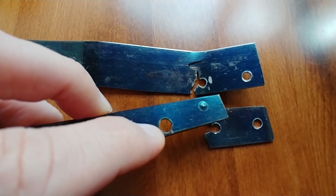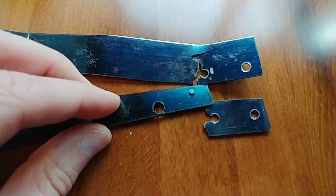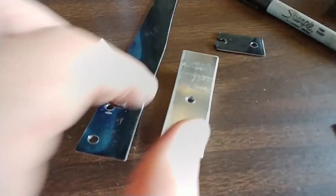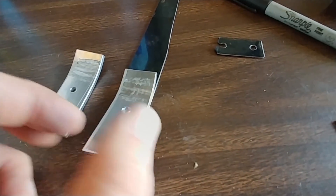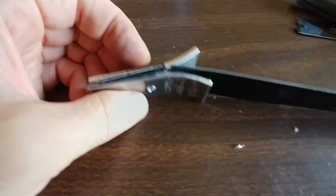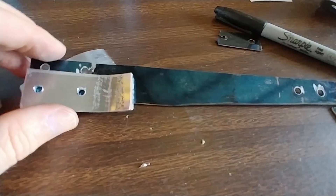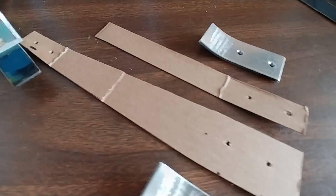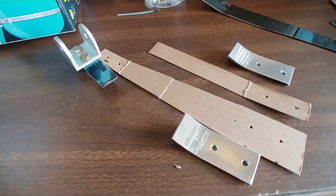I've taken a sample to a local sheet metal shop and they've punched a hole in it as a trial. I've ordered more spring steel from McMaster and I'm going to get them to punch the holes rather than drilling them myself, and they have a shear so they can cut it to shape rather than me using an angle grinder like last time. I've also created these aluminum blocks to distribute the load at the point of maximum bending — so instead of it flexing around where the holes are, it'll bear against those eighth-inch aluminum blocks. I'm still going to have a similar shape, just a little wider on that piece.